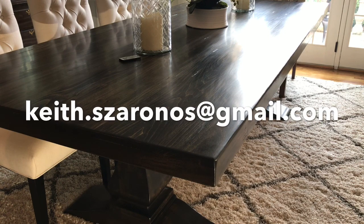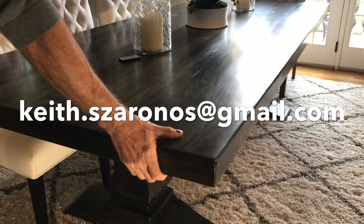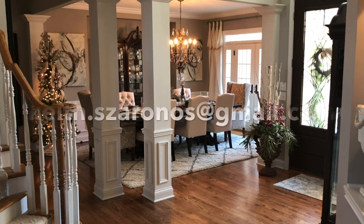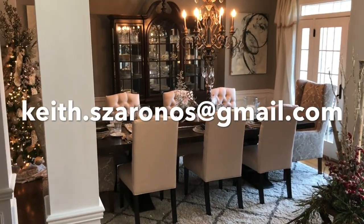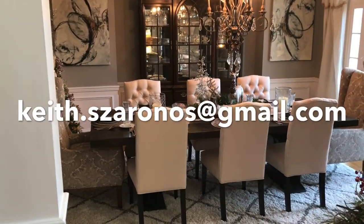The finished pedestal table is now in our formal dining room — had a lot of fun doing this project. After staining, I went ahead and put on five coats of polyurethane. The product I used was General Finishes Armor Seal, in a satin oil-based finish. The first two coats I did as a wipe-on, just with paper towels, followed by three additional coats with a foam brush. I wet sanded between each of those coats, moving progressively up to finishing with a 600 grit. The finish is like glass — I'm very pleased. If you liked and enjoyed the video, please hit like, and if you have any questions, comments, or concerns, refer to my email down below. Thanks for having me along — I'll see you in the next one.